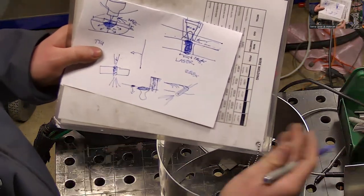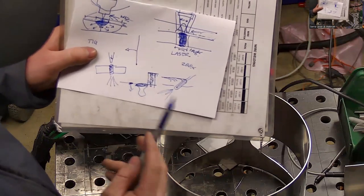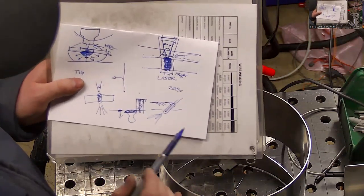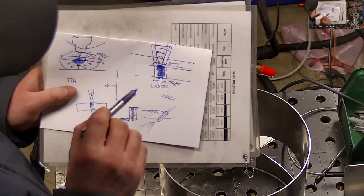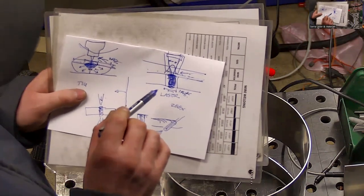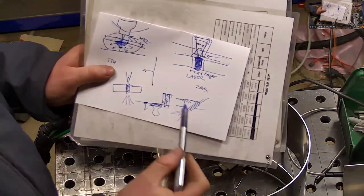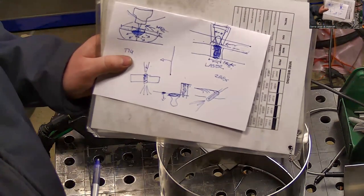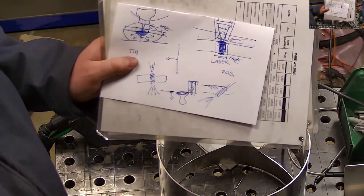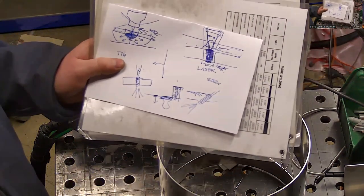And you're moving much faster, so it's melting and re-solidifying extremely fast. I haven't had that happen. I can demonstrate during this demo for you on a scrap piece, but I can hold the laser static at too much power for the material, and it will take quite a bit of time for us to drop through. And sometimes I have to help it, like take a TIG rod and dab the puddle to make it drop through. Interesting. Okay. It's hard to blow a hole with this compared to any other process.